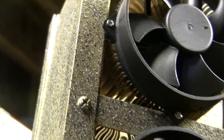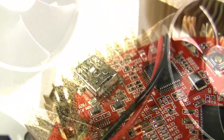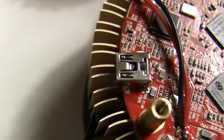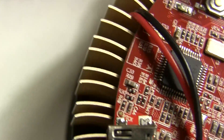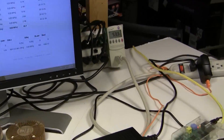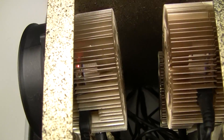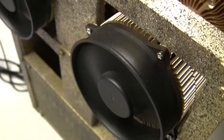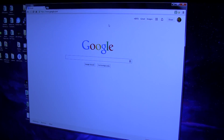Out of the gate you get a fully adjustable clock doing around 330 kilohash. A software mod can push that to about 380 kilohash, and with skilled soldering you can get around 450 kilohash. What matters is power per kilohash — this thing focuses purely on Scrypt coins like Feathercoin, Dogecoin, and Litecoin. Stock it's about as fast as a 7850, and overclocked about as fast as an R9 270, all at seven watts. We originally ordered eight to build a cool case with four per side, but pulled two out for the review to give a better view inside.